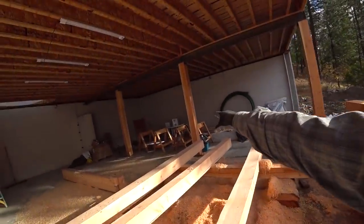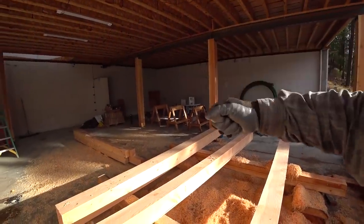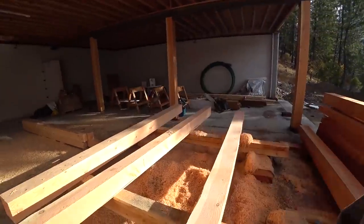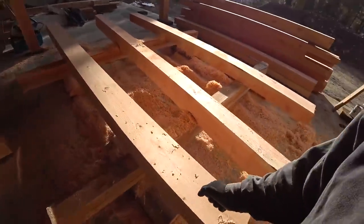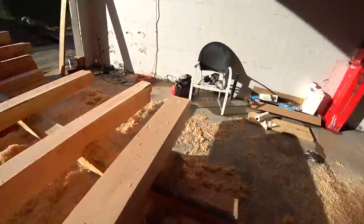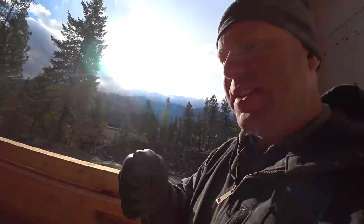If you remember, she was working on sawhorses clear up here, and the planer's up here, and it's just too high. So she ends up rocking the planer just from fatigue. So now she can really lean on the planer and is working much, much better. She also found that using diesel on the planer bed really helps to keep the sap away. The sap really makes the planer sticky. It doesn't want to move, and it's already heavy and hard to move.